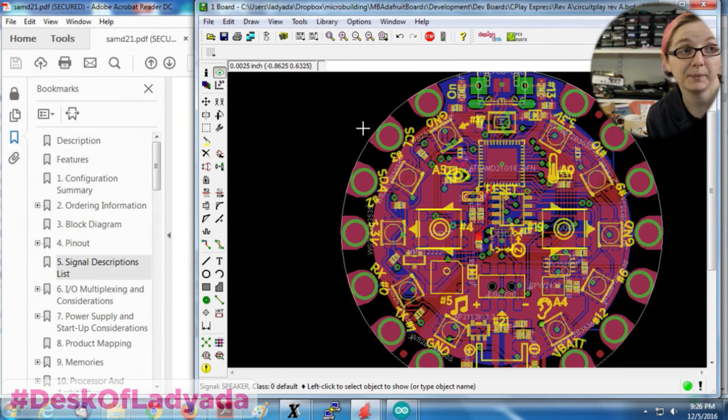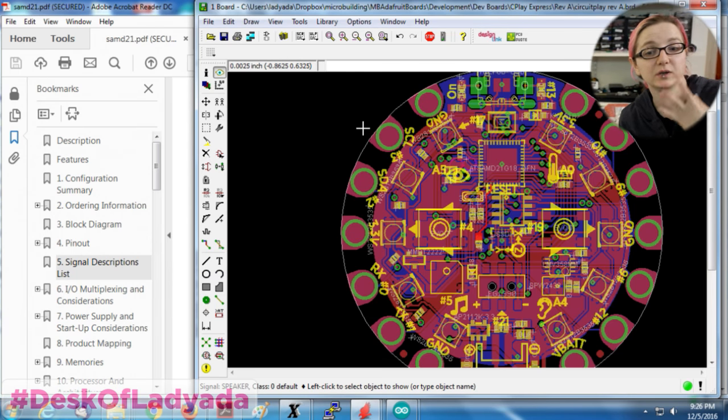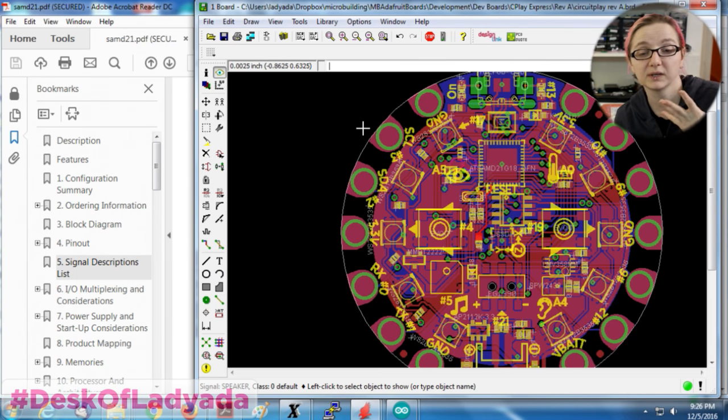And then I save a pin, which is handy, and I don't need to use those four resistors because I'll use the built-in self-capacitive mode. That'll be kind of nice because the SAMD processor is powerful enough to do this, I might as well have it do the internal capacitance mode, get that off of my plate, and it can also happen in the background.